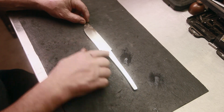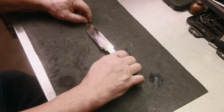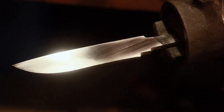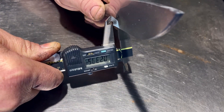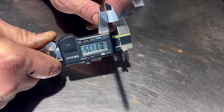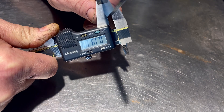The first thing I like to do after knocking the forge scale off is go ahead and bring this ricasso area up to around 400 grit. I do that before heat treat so after heat treat I don't have to spend a bunch of time doing finish work there. I'm going to sand on a slight diagonal so when I come back with the next grit I can see those scratches a lot easier. Now I'm going to check the ricasso to see how flat we are all the way across — we don't want a big angle there because it'll be hard to cut that guard slot.